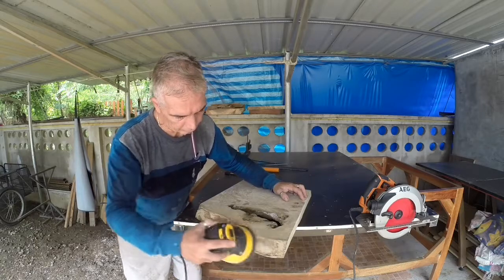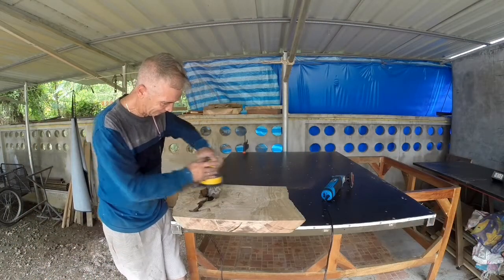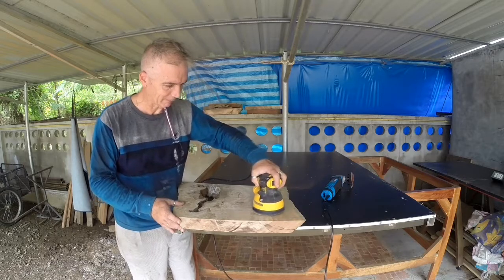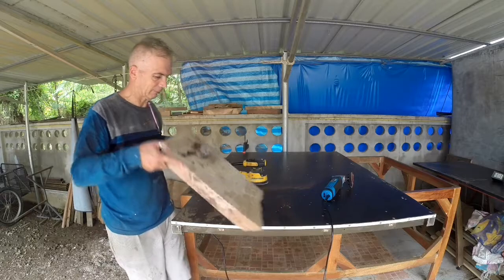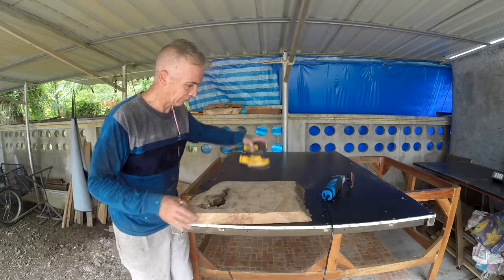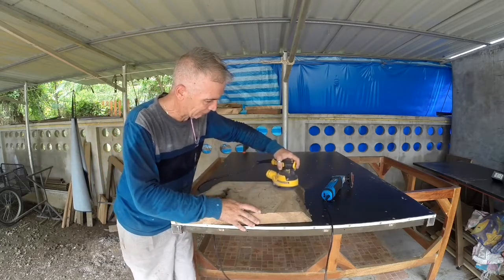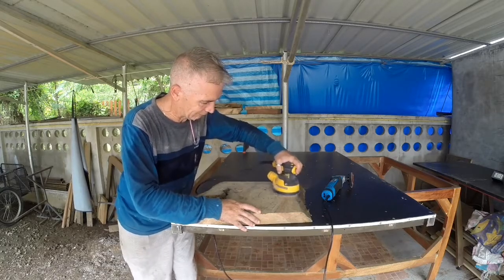I'm sanding all the live edges. I'm finishing the cleaning process by sanding both slab faces, to eliminate all router marks left by the flattening process. I'm referring to my first video episode of this series — here's the link — where you can see my flattening surface sled at work and how I flattened this piece of timber.